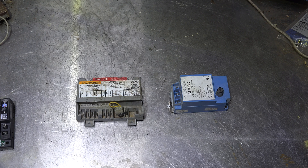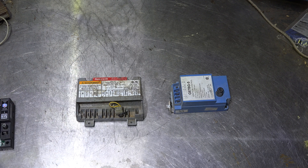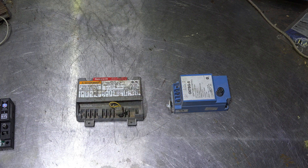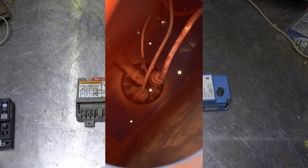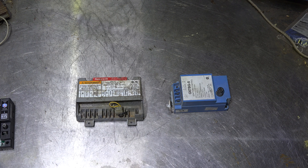These were very common in the 80s in furnaces and are still widely used in other burners. The type that's not here is direct spark ignition. Direct spark ignition looks very similar to these except instead of lighting a pilot, it actually lights the main burner directly — so the main burner comes on with the spark.